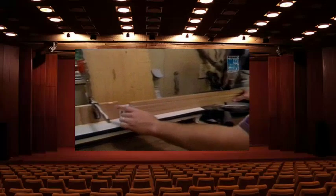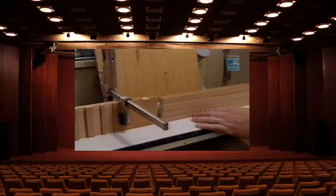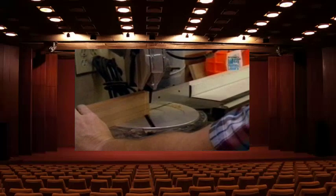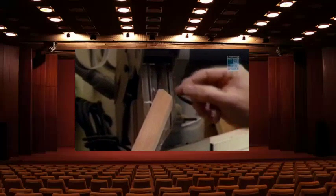Because there are so many cleats to make it's worth setting up a system to cut them in multiples, so I've attached a scrap piece of one-by-four to my fence that allows me to cut four cleats at a time. I've turned my saw to 45 degrees to cut the bevel on the end. You'll notice I did not cut it to a point — there's about an eighth of an inch of flat material left.